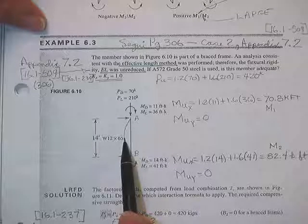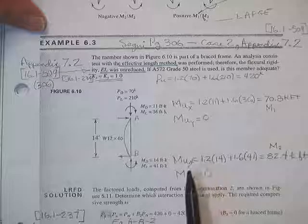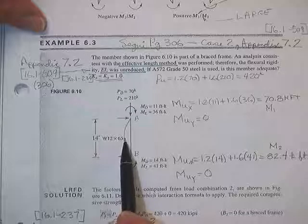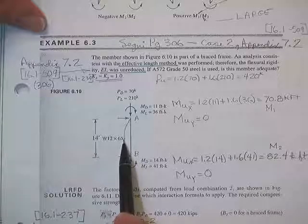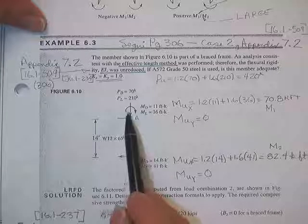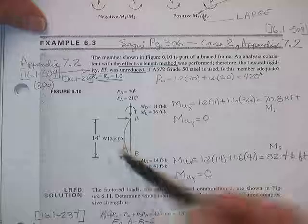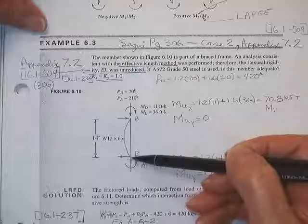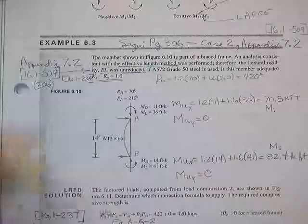And you're going to ask him, please give me the buckling load about the XX axis. That's right. Because that's the axis about which you caused a delta problem, a P delta problem. And so when you get into the equation and it asks you for Euler's opinion, be sure you put in XX numbers. Now, if somebody said, look, I've got moments about both axes, then when you do the load, you'll be finding moments about the X axis and you'll be asking Euler's opinion. And when it bends about the Y axis, hopefully you've at least got the big moments about X and the small moments about Y, then you'll be putting in all the Y numbers for his opinion about the Euler buckling load.